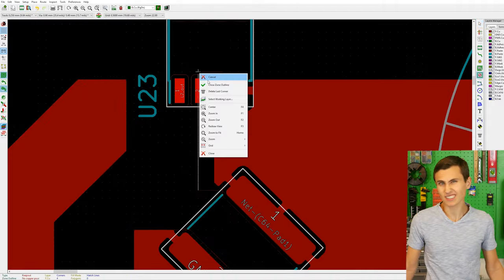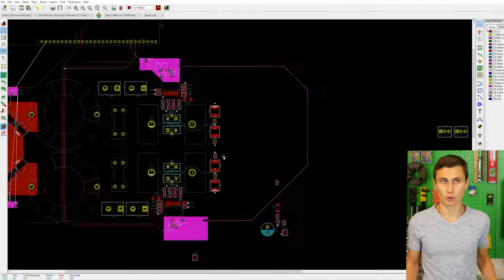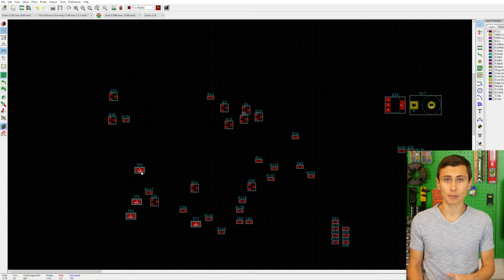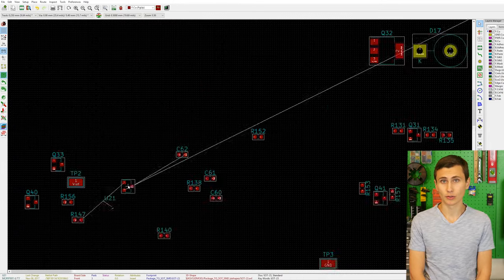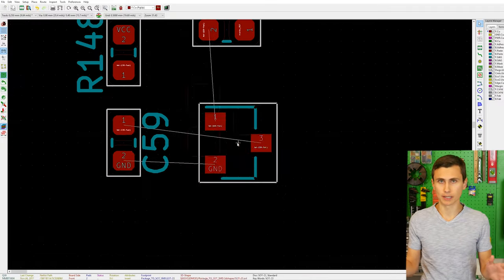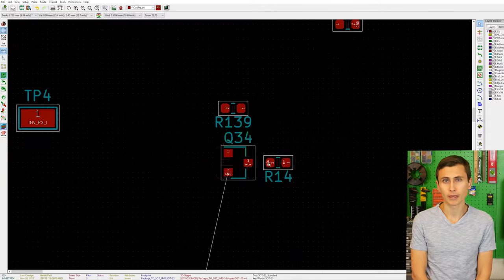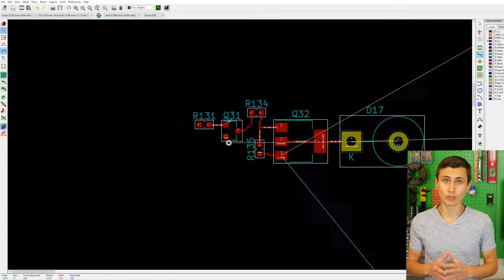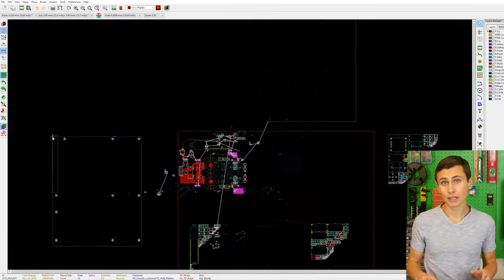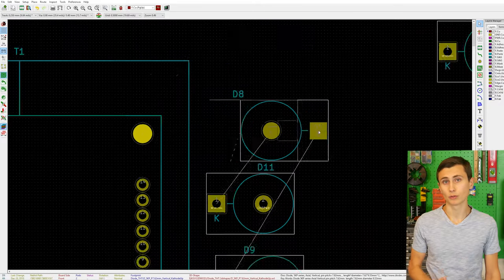Optimization probably takes the longest of all the steps. As a designer, seeing unusual routing raises red flags — like a net that needs to go halfway across the board, or a component crossing an isolation boundary it shouldn't. Multipart packages like four-gate op-amps give opportunities for these mistakes if gates are used in different parts of the design. I like to keep all gates for a single physical part on one schematic page unless there's a good reason not to. Optimization is fundamentally about seeing things you don't like and fixing them, guided by electromagnetic compatibility, or EMC, design rules.